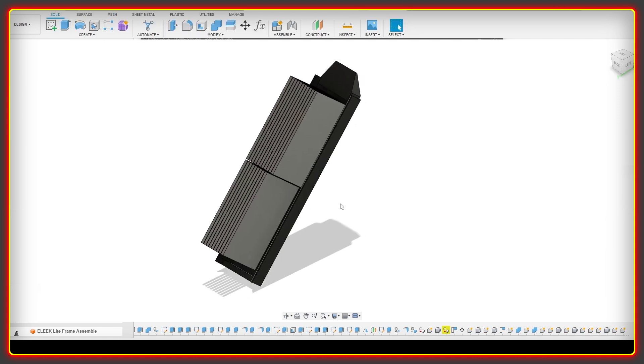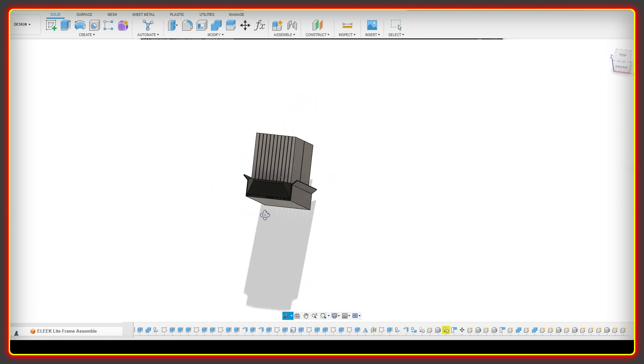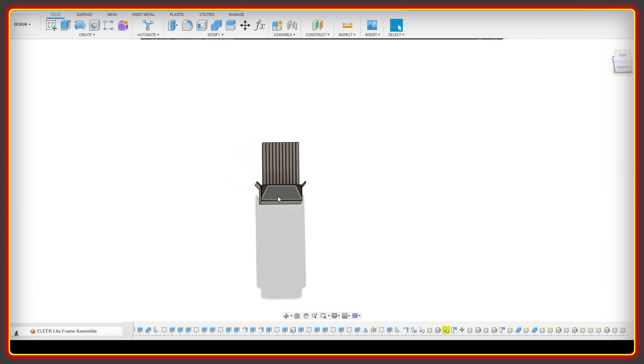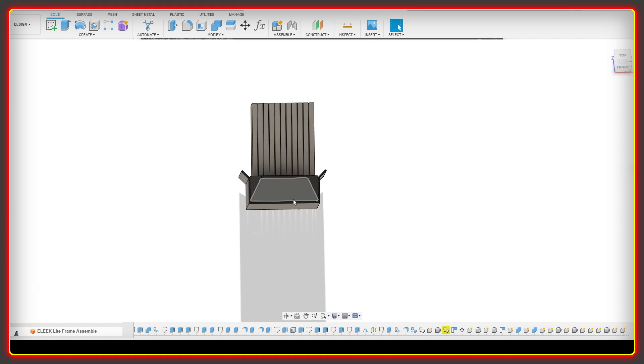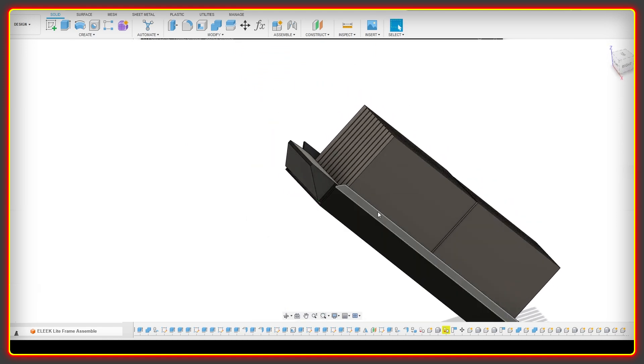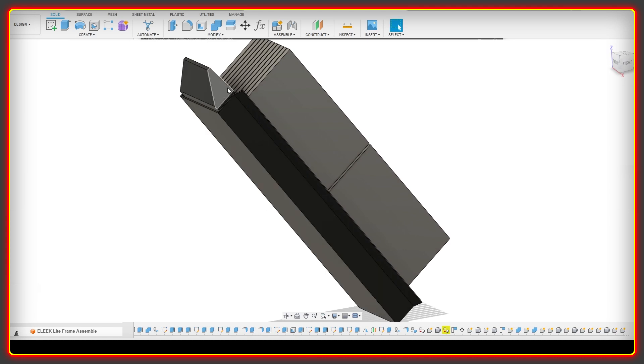So this is what I think would be a good compromise — we're still using metal, but it's been reduced to a minimum number of cuts as well as the most efficient shape. Effectively you need a sheet of metal with the right dimensions, bend it in four places, and punching and drilling the holes for bolts should be fairly straightforward. The rest of it is going to be 3D printed parts to go at the front and the back.